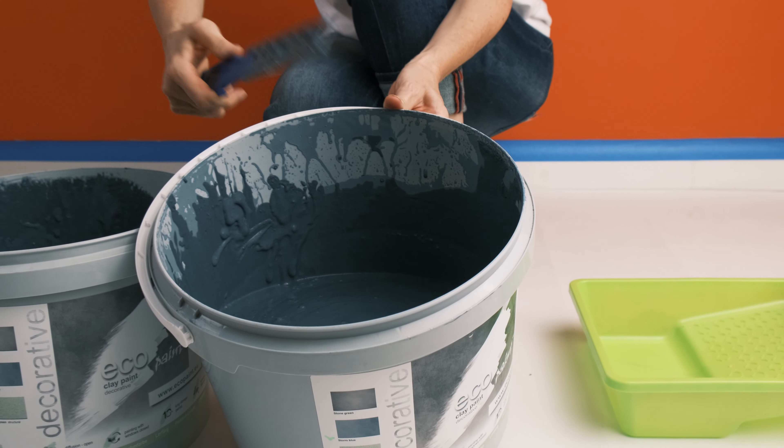To achieve the desired polish stone or tadelakt effect, we recommend 3 coats of paint. In order to highlight the decorative effect, the last coat should be applied using a diluted paint, adding as much as 30% water, and by firmly scrubbing the chosen painting tool — whether roller or brush — against the surface.